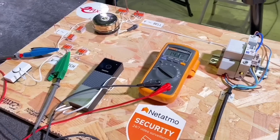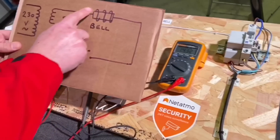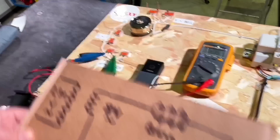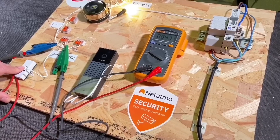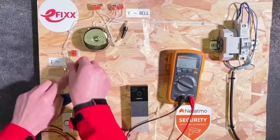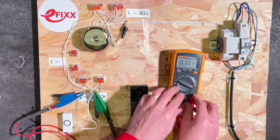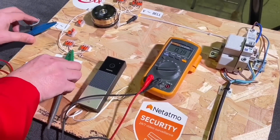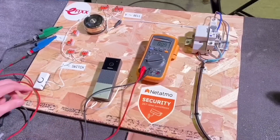You'll also see there is a voltage present across the terminals of the switch. In the past you may have had a little incandescent lamp there to illuminate the switch so you could see it in the dark — that's because the voltage flows through the windings of the bell itself. We can see the voltage goes to zero when we push the switch because that's closing the circuit. Can you measure the current now? Yeah — this is why we have this problem where the voltage is a lot higher than we'd expect; this transformer's rated up to an amp. Let's just see what sort of currents we're dealing with here.